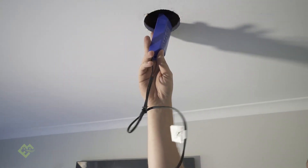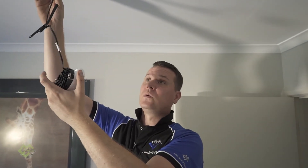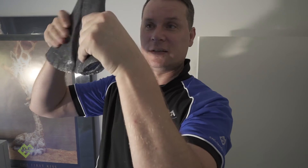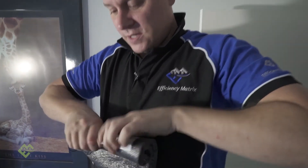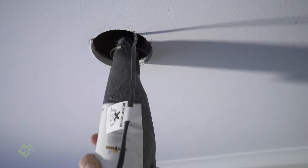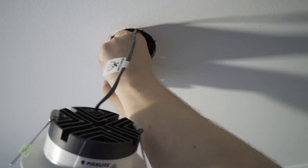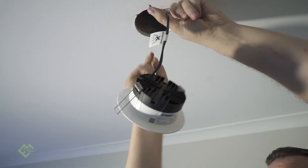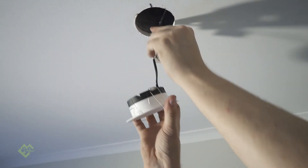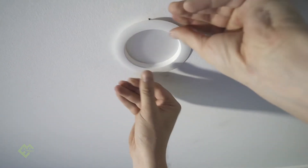This is an LED driver or LED transformer — it can only be used with an LED luminaire. If we try and hook up a halogen globe to this, it will not work. To fit the Downlight Mitt up through a 90mm cutout, you fold it flat and then roll it up nice and tightly. Push it up through the hole and it bounces out. Then grab the two wire fixings and push those down into the plaster — you can even push them under the plaster. Then fit the luminaire back in, and that's done.